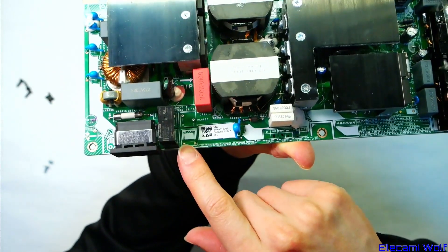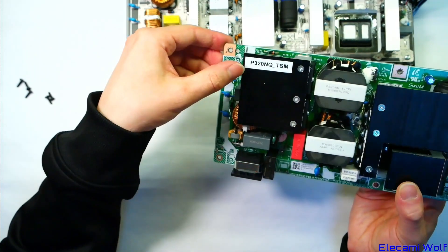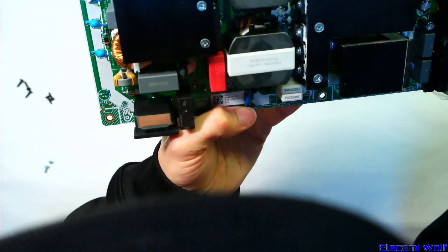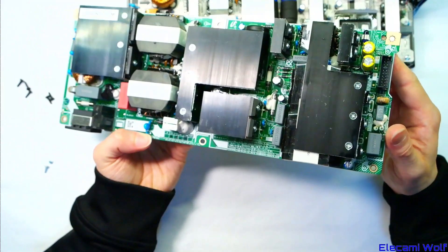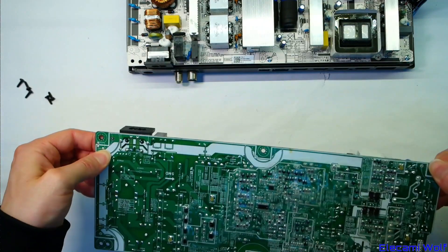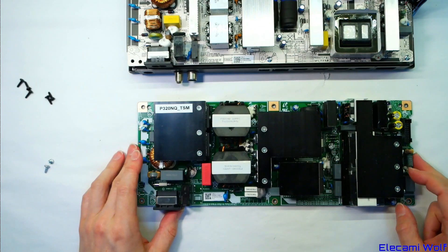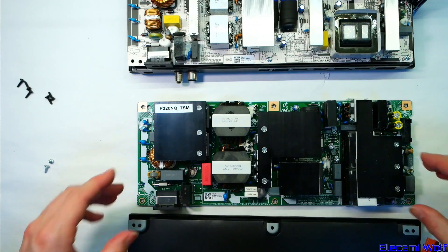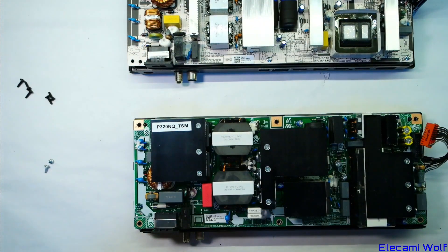This one only has one relay, because the other one had two — this little one and this bigger one. I don't know what that is; that doesn't look original. Do you think it's been reconditioned? The fuse values they indicate for different regions don't seem to match the fuses I see on this board. There's very little output capacitance for the high voltage — just those two. That matters somewhat from an interference point of view. Well, that's pretty interesting and surprising. I didn't expect it to be that different. Maybe it's not so surprising since this is one year earlier than this one, according to the label on the bottom.